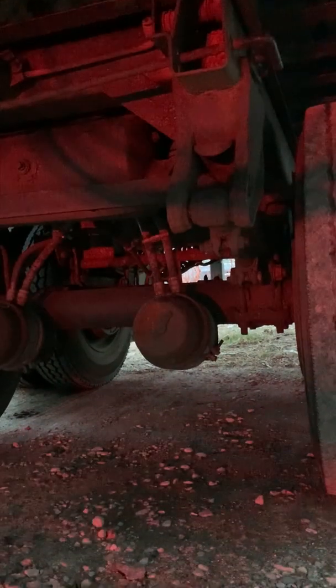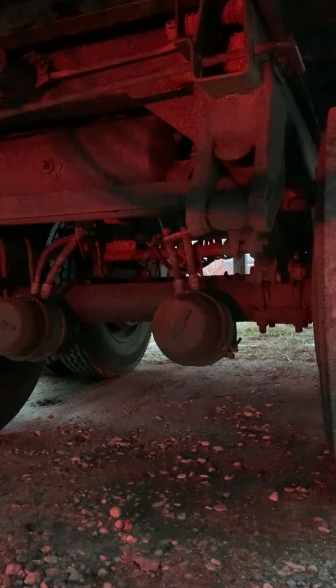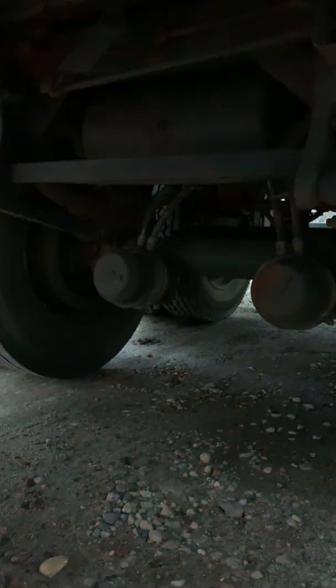The brakes, mostly similar, so brake chamber and hose are secure, no missing hardware, no audible leaks. The slack adjuster and push rod coming off the back is secure, not bent or broken. In order to check for play, I would have to chock the wheels and release my trailer brake. My drum and lining are secure, nothing stuck in there. The lining is at least a 1/4 inch thick.